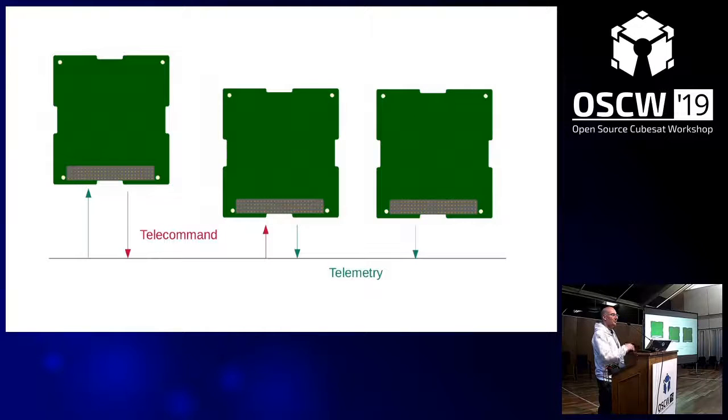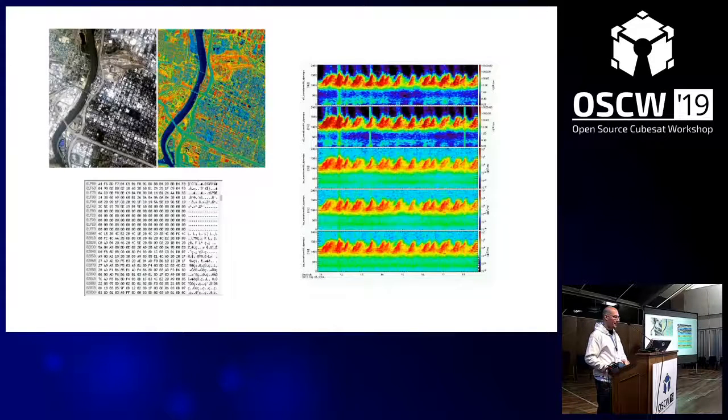If you have a decentralized or fragmented CubeSat design, it might look different, but you can still use the SpaceCAN, the CAN bus. Normally, you have an onboard computer that is controlling all the other nodes, like the power system and the communication system. It sets the modes and reads telemetry from them, exchanging telecommands from the master to the slave nodes and reading out telemetry from them.